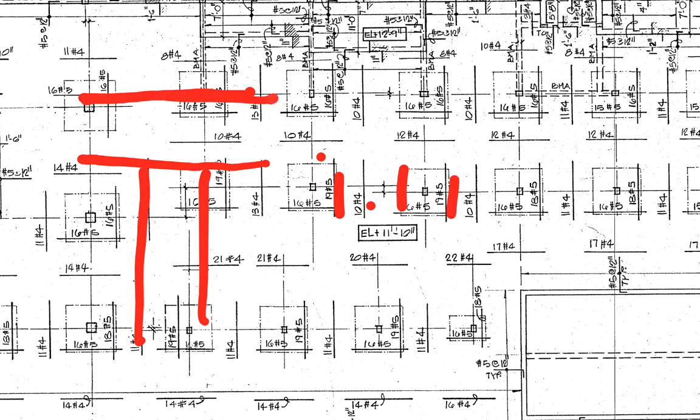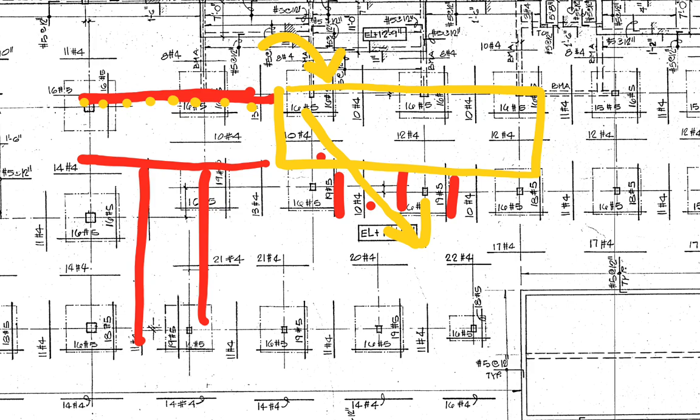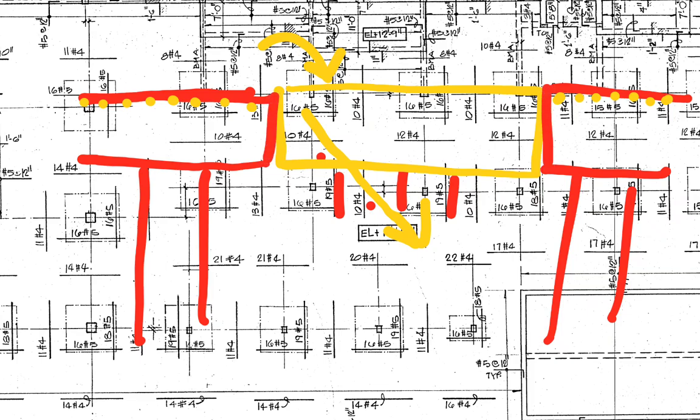There will be 19 fives crisscrossing each other at the top. That's the steel that stops the deflection — as the deck tries to deflect and pull down from one span to the other. So in yellow is what I'll call the tributary area, and in the red box is your critical shear zone — CSZ. And this is your tributary zone between them. I showed you in a video a long time ago: when someone sits on a chair, the legs at the corners are the critical shear zones.